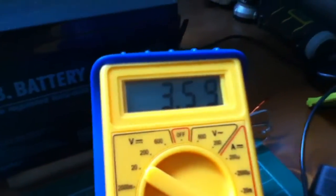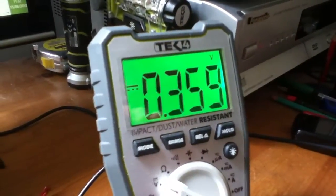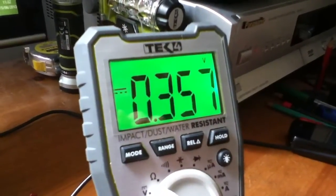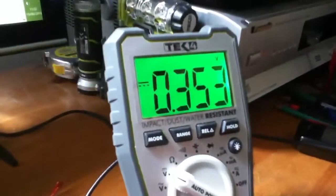Let's see how warm it is — oh, it's just mildly warm. So let's put some more of these lamps on, some of the bigger ones. That's 3.5 amps now, and you can see on this thing that it's gone up to 0.36V. It's dropping again because it's presumably getting warmer. Yeah, it's just warm now — so about 0.35V forward voltage drop.